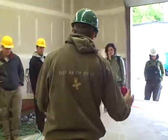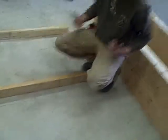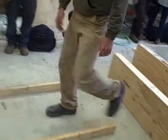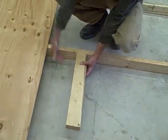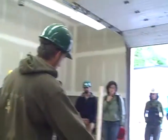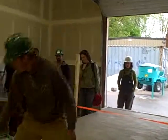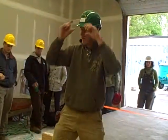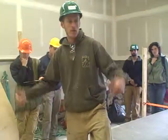Because we got the plywood on runners - three 2x4 runners underneath - so that the straps can go under the runners and through the thing. And we can probably with a boom truck just pull the whole wall out, slide it along the floor on the runners and then lift it up. We had blocking in the runners as well, under where the seams of the plywood would be, and we put the blocking sideways so the straps could fit under them. We did the runners inside of the wall because on the edge there is a 2x6 that runs along the sides, which connects to the walls on site. So we got the 2x6 that's kind of embedded in our walls, with the screw nails.